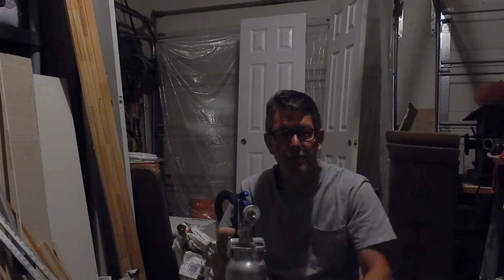I'm going to be doing some spraying of some doors, and I would like to show you how I do that. I'll be using an Earlex HVLP sprayer, high volume, low pressure. So it's a high volume of air that's coming out, but very low pressure.